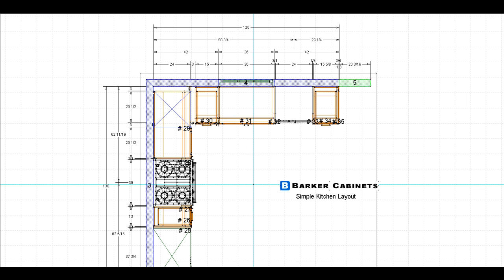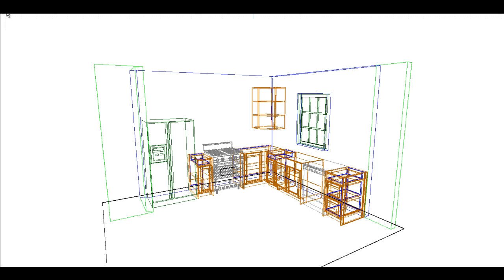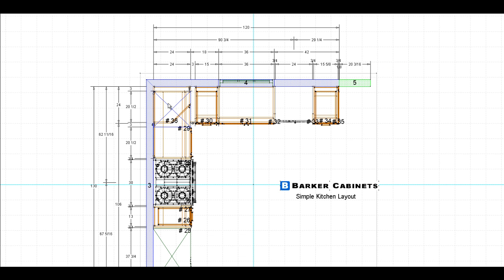All right, so going into upper cabinets, something to keep in mind here. The first thing you want to do is start off with your corner. Now you can do lots of different things for uppers. Okay, so I'm in the wrong category. Let's go base, let's go wall. So this upper cabinet, you could do a wall 45. Not my personal favorite cabinet. I mean, it's okay. It gives you a little bit more room, but it kind of eats up that corner space a little bit too much.